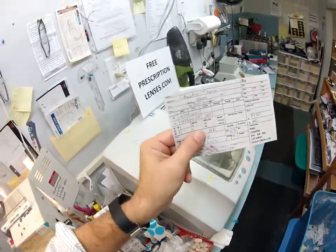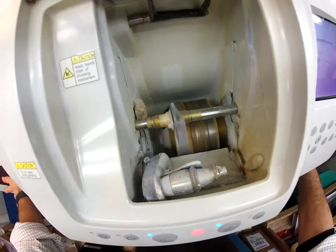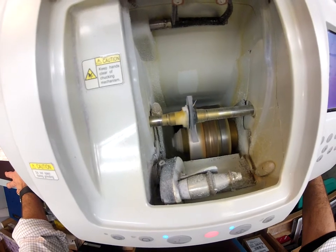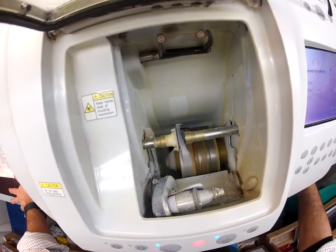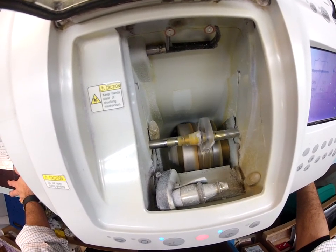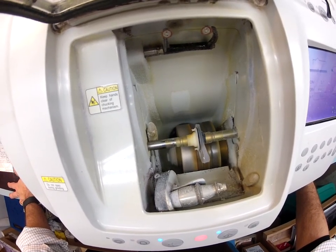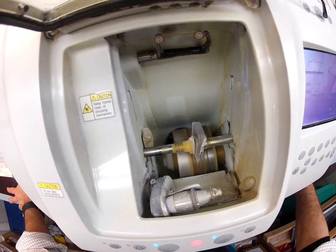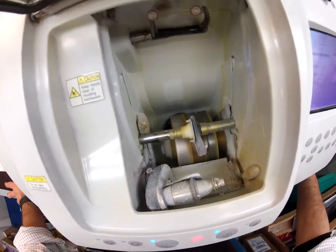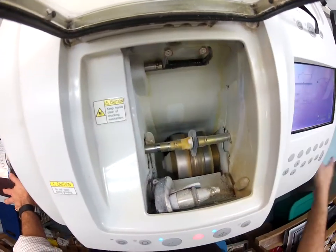Your lens is still cutting — still flat at the edges, just like a nickel. If I were to take it out it would stand up on its own. It's going to move over and put the bevel onto the lens. Polycarbonate lenses cut dry — you see water running in the background, but in a moment the water will come in and clean away all the debris, like that little piece of optical sawdust.